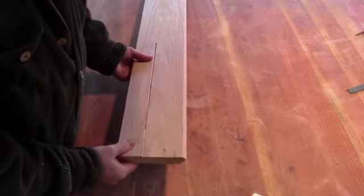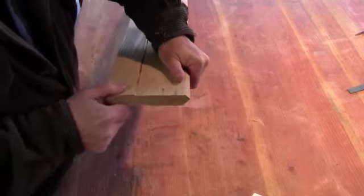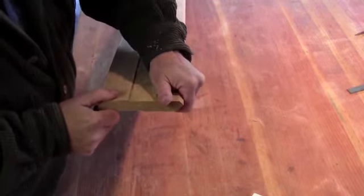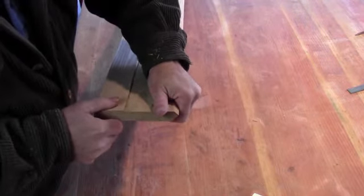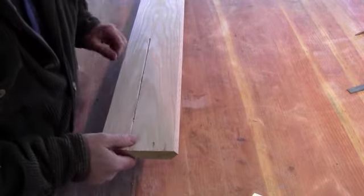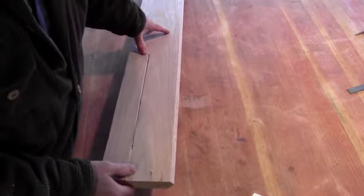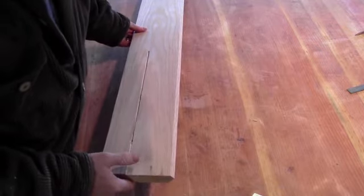I want to take a second here. As you can see, I wasn't able to complete the cut. If you look, you can see this saw had an incredible amount of bind in it. I didn't get that in the previous piece I cut and I thought this piece might be okay, but it is not. So what I'm probably going to have to do is actually rip off a smaller vertical strip of this, and then I can go back and make the cut I need to make. Right now it won't cut the way I'd like it to.